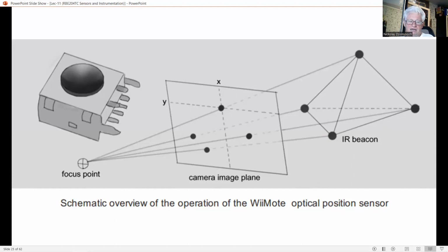Further, mirrors are connected at the top of the ball. They follow the rotation of the ball when touching the object. A set or a bundle of fibers is fixed to the stylus with their ends just above the mirror. According to the principle of this figure, the ball movement is measured in two directions, normal to the stylus. Ball deflection down to 1 micrometer, corresponding to a sideways force less than 1 millinewton, can be readily measured.